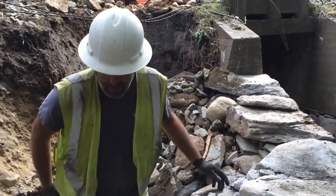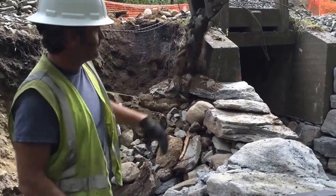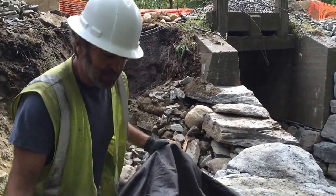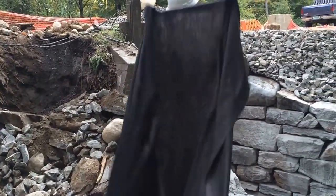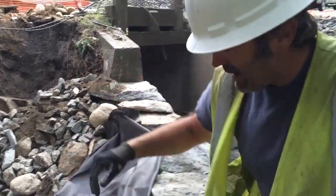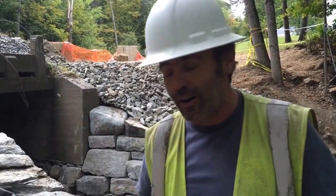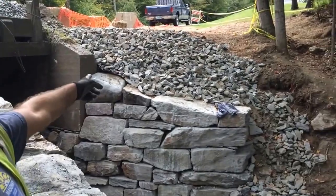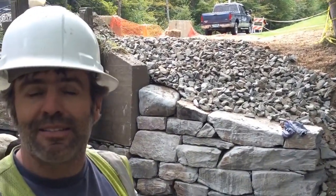I just wanted to show you what's going to happen now that we finish the wall here. We've got this filter fabric — you saw how thick it was earlier. This is all loose fill that Dave's been putting in. So now what we'll do is pull this fabric over. That'll slide down and cover the rock right there. And then we'll be taking some nice loose granular bank run — that's what it's called — that'll be backfill on top of here. And then you can see across the way we'll be covering it with rip rap like that. That'll be the finished slope. We can see the top part up there.